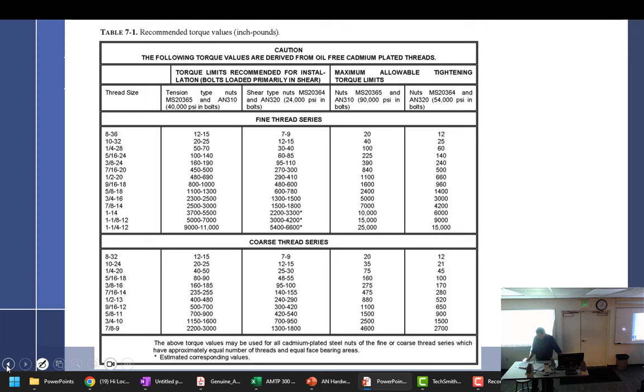Let's see. Aircraft screws generally come in four sizes. What are those four sizes? Number 10, which is the same as a 3/16. Quarter inch? Nope, that's a bolt. Screws. You said a number 10. Number 8. Number 6. Number 4. Which one's the smallest? 4. All right. There is no such thing as a structural PK screw. Be aware of that.